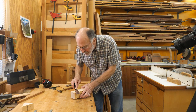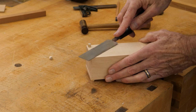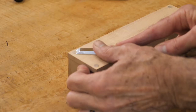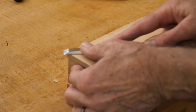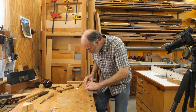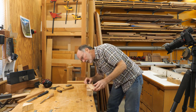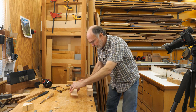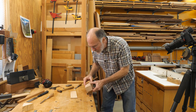I've got a flush cut saw here. I've got this in a vise now, and I'm going to use a chisel just to make sure those are nice and flush. Now that those are flush, I need to get this side off of here and be a little careful. This is my glue scraping chisel — I'll take that and carefully get it off. I'll do the same thing on the other side.